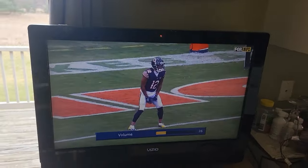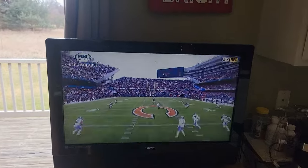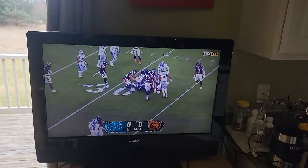And that is it, guys. I hope this video helps you out. It shows you how to make a quick antenna to get the Lions or your favorite football game going. Make sure you visit tvpassport.com to find out what channels are available in your area. Write them down, keep doing the channel scans until you find what you're looking for. If you find the channel without a picture, do not run another scan — just jack up the volume and move your antenna around until you pick up the signal. Hopefully this will let you host the next NFL party at your house. Stay safe and thanks for watching.